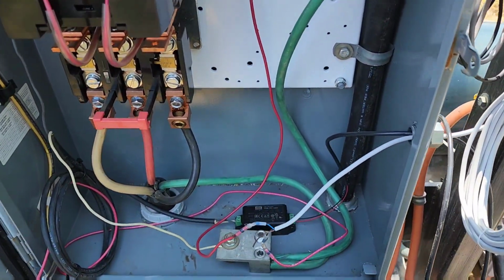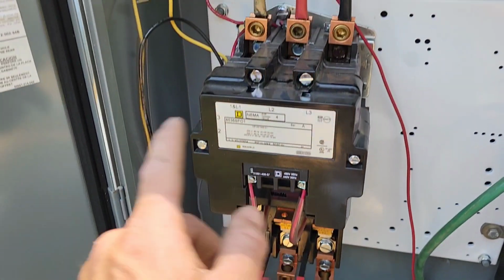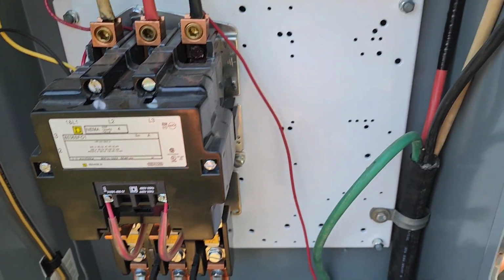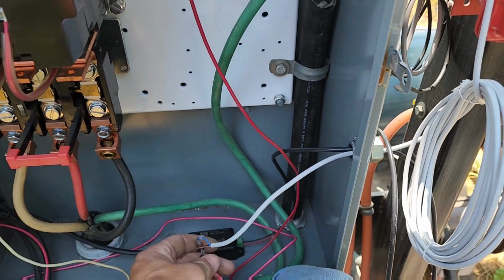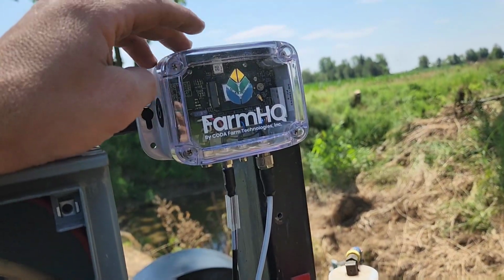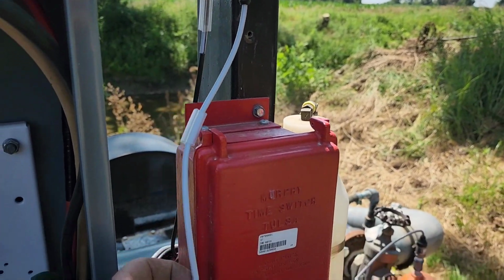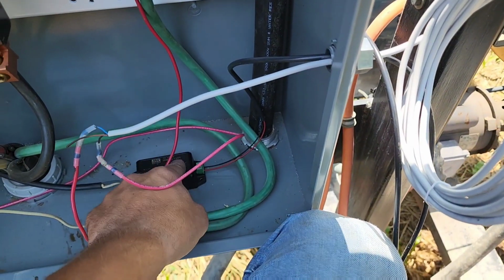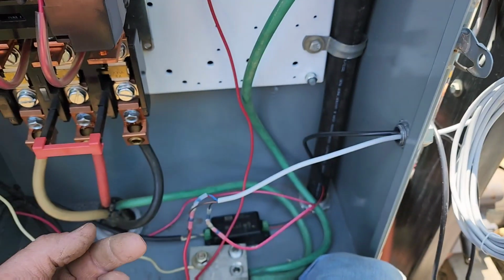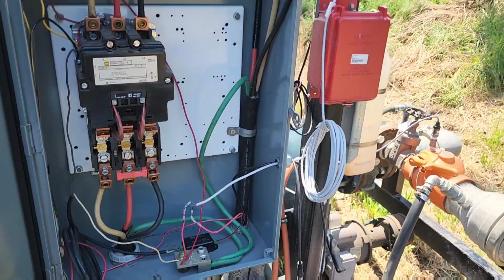This is what we've got to take care of yet. So I talked about this yesterday and a little bit of yesterday's video. I do not think I can control this with 12 volts. I don't think that's going to work to separate the control system out, just looking at it and how everything is hooked up. So what I need is a relay. I need a relay in this red wire to turn on when it gets power from here. And I realized after I was watching yesterday's video back that the relay in here that's controlling that isn't actually sending any power. There's no 12-volt power coming down this wire. And so what I will have to do is actually tap into this power supply on the black wire, send power up it, and then bring it back and put a relay in. I think I can send power through it because it's just a switch to turn it on and off.